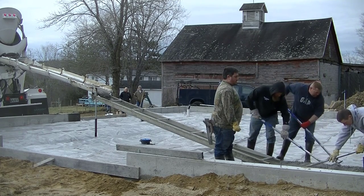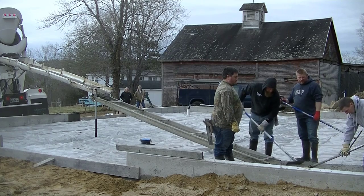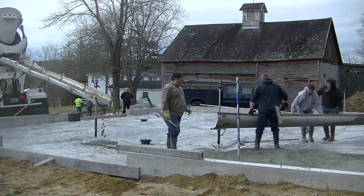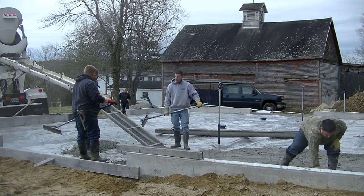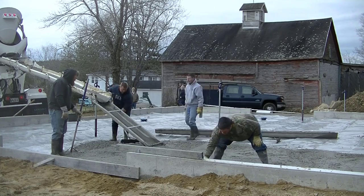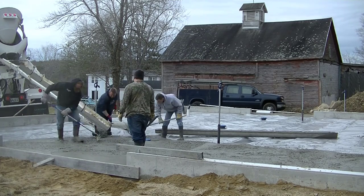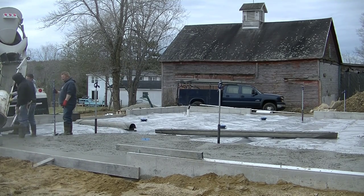On this job, like a lot of my jobs, I'm just hired as a sub. This isn't my job — the guy that did the concrete foundation hires me just to come in and pour the floor. My job is just to come here and pour and finish the concrete. Sometimes we do a little bit of the prep work like on this one, but I don't design the floor or draw up the specs. All this floor called for was 4,000 psi concrete with fiber mesh in it, and a 6 mil poly vapor barrier down to help with moisture. The concrete is charged to the foundation guy, and I just send them a bill for our labor.